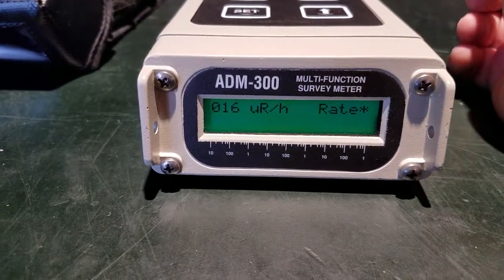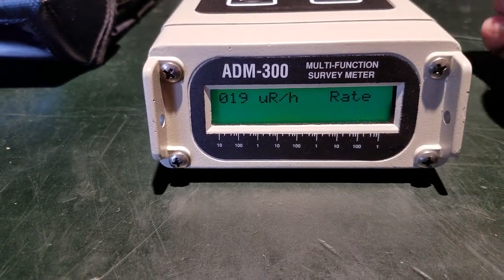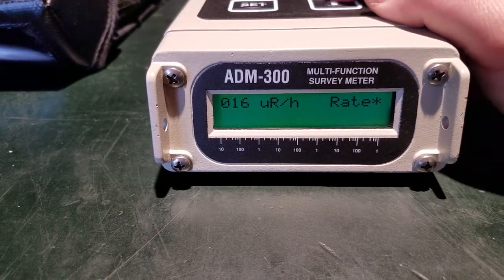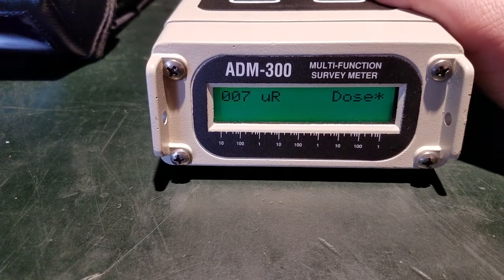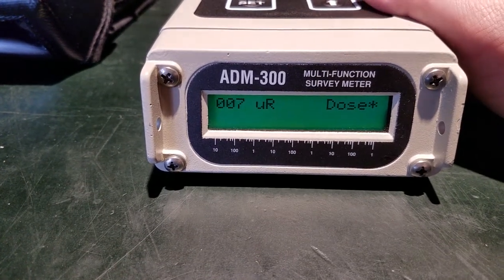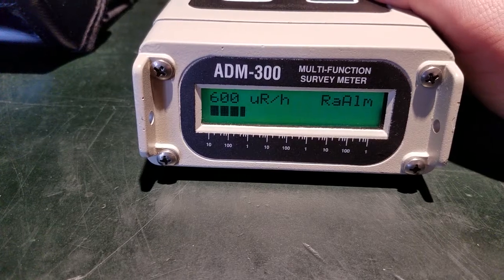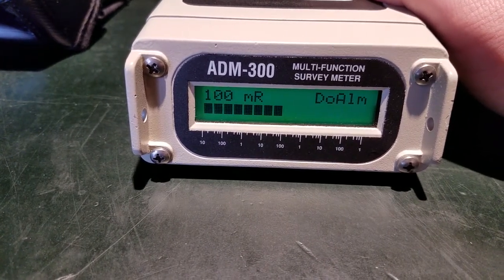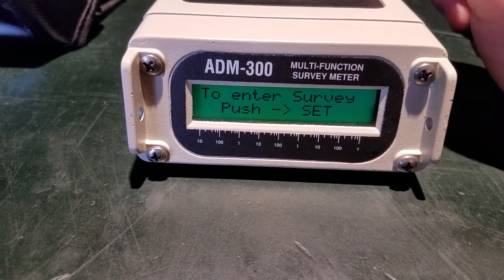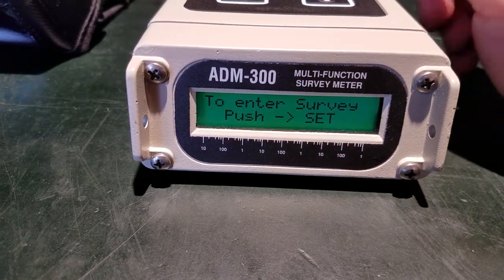We'll cycle through the modes here — I'll turn the light on. Dose rate. This asterisk means that audio is on; with the asterisk gone, the audio is off. If I hit audio again I'll also get the audible beeps for detection events. Then we'll hit mode again — absorbed dose, seven micro-roentgens per hour. I know that this either comes in or supports micro-Sievert or Sievert scale, but I'm not sure how to change that within the unit. Here we can set the dose rate alarm and the dose alarm itself. Then here's how we activate survey mode — it goes for two minutes, averages all the counts, stores them, and you can store up to a hundred surveys on this thing.